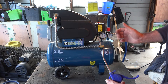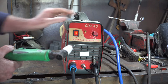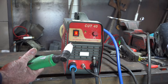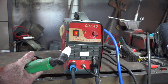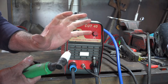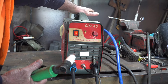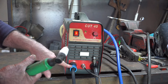Right, so we know it's not the compressor. Now let's move on to the plasma cutter machine itself. We've got a couple of possibilities with this - turn the machine on and we don't get any air. You just hear it going buzz buzz buzz, which basically tells us it's trying to create an arc but it just doesn't have any air to start the plasma up. We already know our compressor is getting air to the back of the machine because we tested it with the air gun. So now we just undo the airline here.